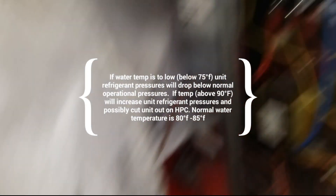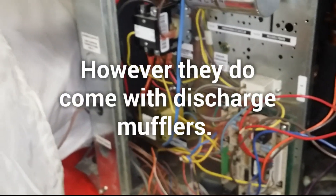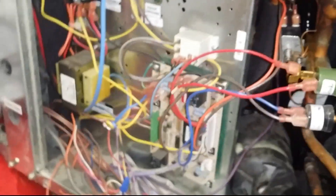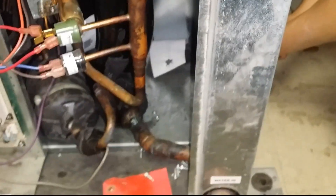Just remember, proper water temperature is key. You've got your reversing valve here, and your TXV is somewhere back there. Most of these units do not use liquid line dryers — some manufacturers do use them, but in most cases I have not seen them, and I work on these a lot. There's your control board — there's nothing to be afraid of. It's a lot more simple than your traditional air-cooled heat pump.